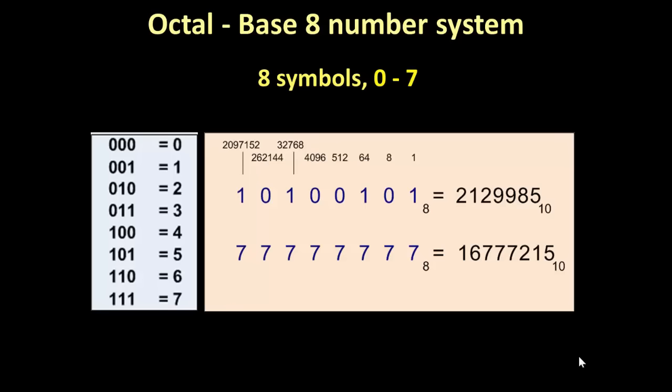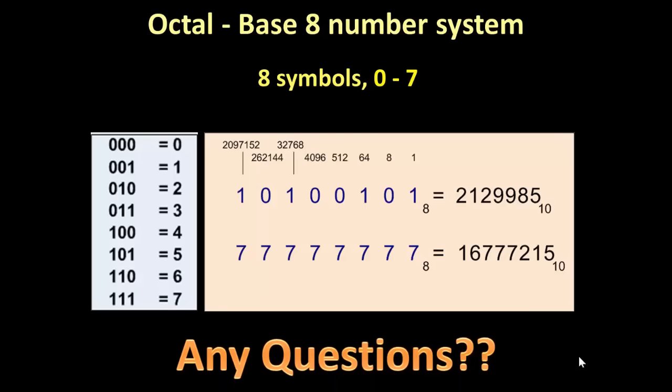You won't see this in any new PLC, but in the older PLC 5s, PLC 2s, especially the 1771 I/O configuration for what was called a rack of memory, you had 2-slot addressing, 1-slot addressing, half-slot addressing, and it all revolved around the base 8 number system. I'm sure you have lots of questions, but this will basically take care of an introduction to different number systems. The one that we really care about the most is binary.